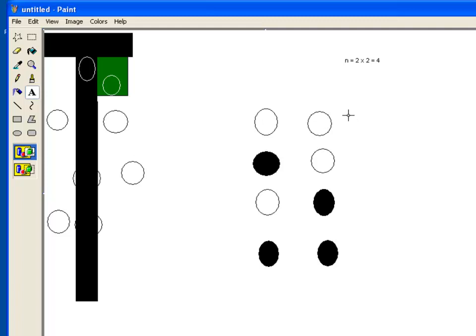So the four possible combinations for the light sensors. If both light sensors see white, the robot is straddling the black line, probably facing forward on a straight section - we want it to go fast forward. If the left hand sensor sees black and the right hand sensor detects white, we want it to turn towards the black, or turn left. Likewise, if the right hand sensor sees black and the left hand sensor sees white, we want the robot to turn right. If both sensors are over a dark colour, possibly one black and one green, we want the robot to stop, then execute the detect green, then turn. And that's the basis of the algorithm we're going to execute.